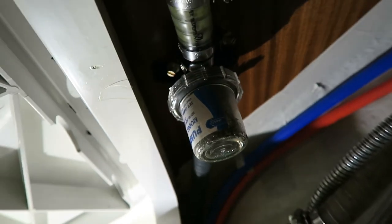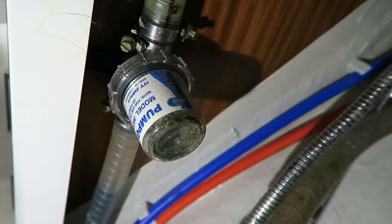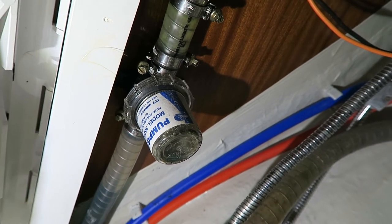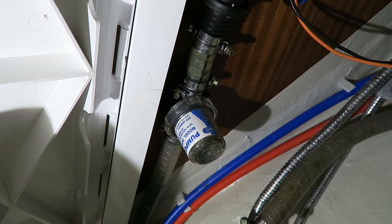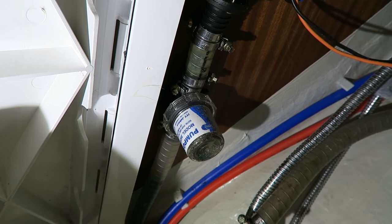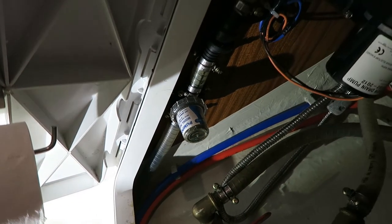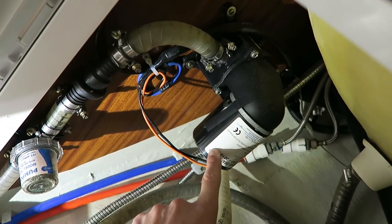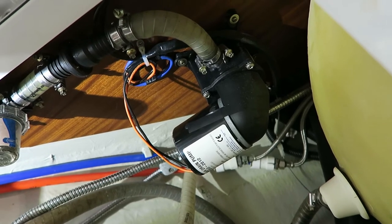When I take a closer look, I can see it is almost full of debris, sand, and dirt. I think I will first try to clean this pump. Last year when I had my boat in the water and was draining all the drains, I don't think the drain was flushing the water out of the system very fast. I think it's because this pump guard is full of dirt. I will try to clean it and maybe also remove the pump and check if everything is functioning correctly.